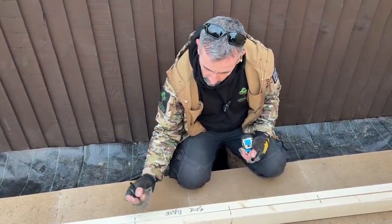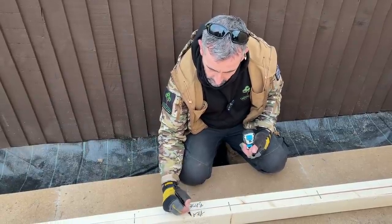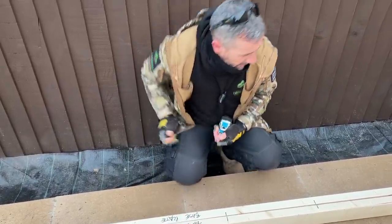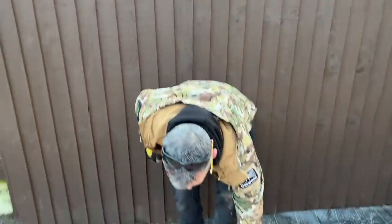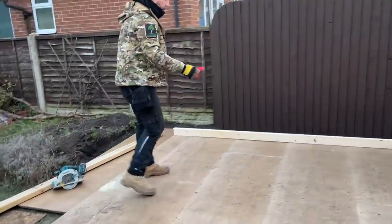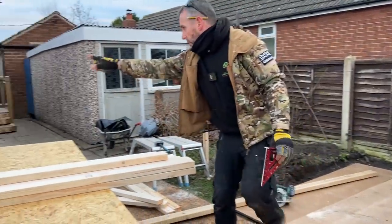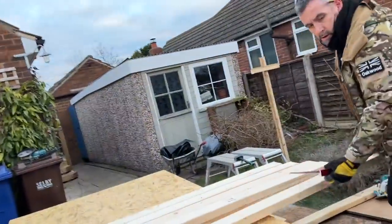That's my base and that's my head. I'll separate them like that and then cut my studs — they'll drop in there and I'm going to start hand nailing them.